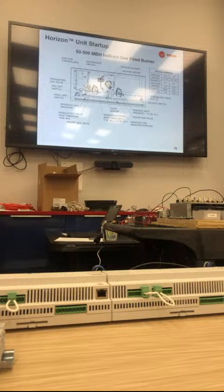So that's an issue. We're also going to show you issues with our combustion blower. There is a manufacturing defect with combustion blowers this year too from Beckett. How many have replaced combustion blowers this year? Yeah. So we know that's coming, which is to make you aware of, those 10-degree days when you're calling back and everything.